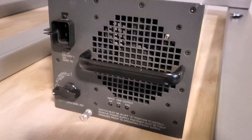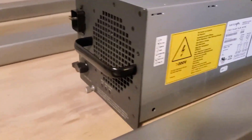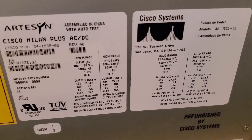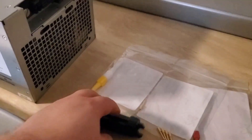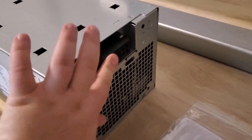One of the suggestions from the PrintNC Discord community and wiki is to use the Cisco power supply. These are fairly cheap on eBay and provide 1300 watts of 42-volt DC for more stepper motor torque and speed, as well as 12 volts, 5 volts, and 3.3 volts. I ordered the plug and pins from Mouser so I didn't have to modify it internally.